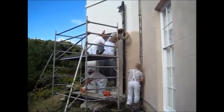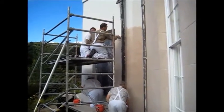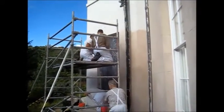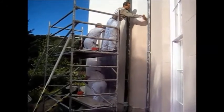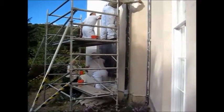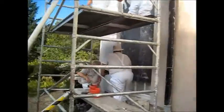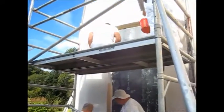Two painters have applied down below and two have now gone up the scaffold to keep the wet edge going, met them from above. Once they get a bit further up, two painters will start on this side and come up so that the two can meet in the middle. Don't paint in full sun — it will dry a lot more quickly. Sometimes you absolutely have to, but ideally paint in the shade — you've got a lot longer working time.